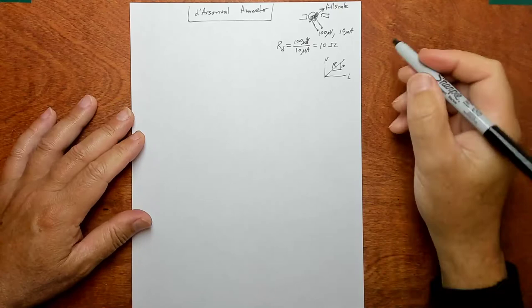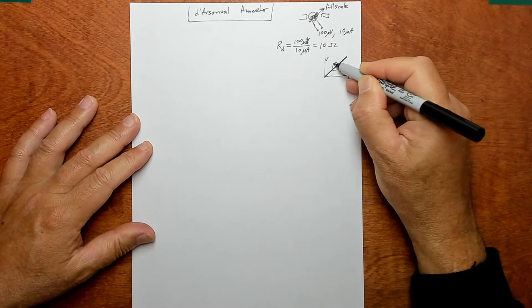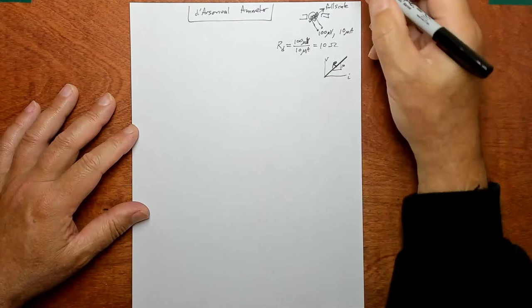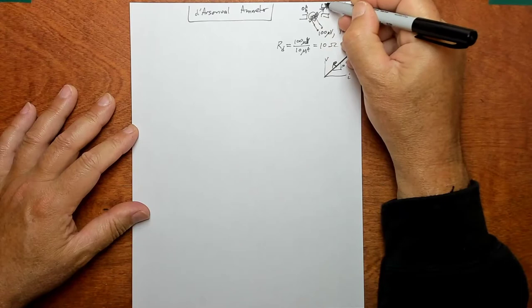This is assuming that the slope is 10, and if this were a resistor, we typically think of it as having a straight line curve. So that's another trick in making these things — constructing them such that the relationship is as straight as possible. So the scale: you're going to put a scale on here, this side is zero amps. And then when the needle goes over here, what are you going to label this?